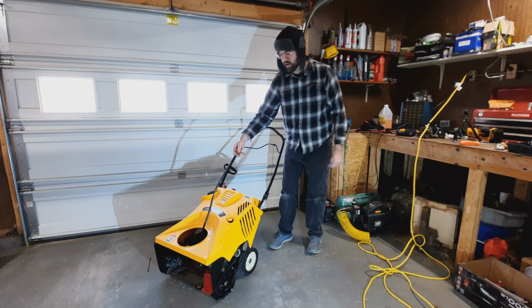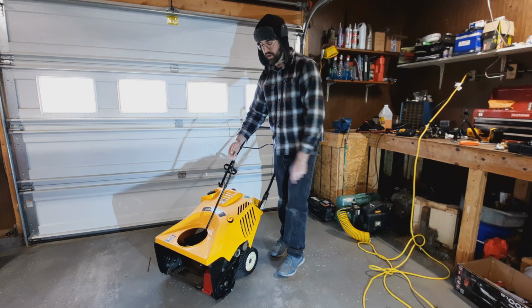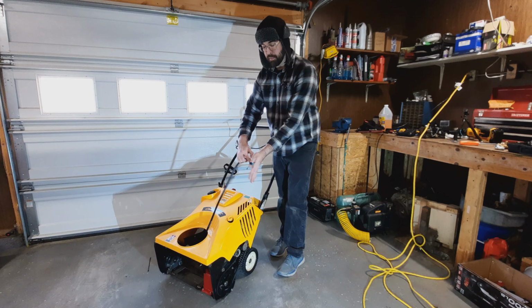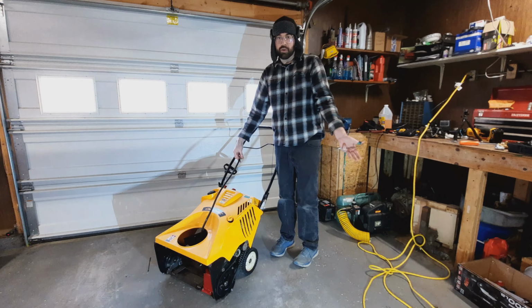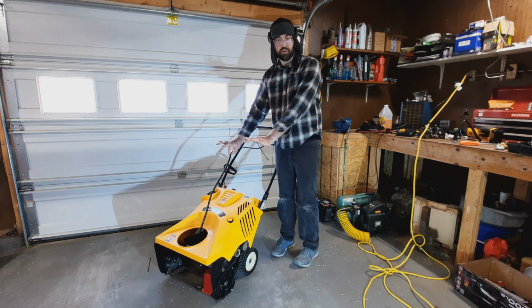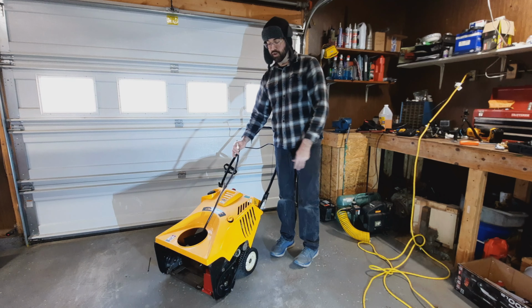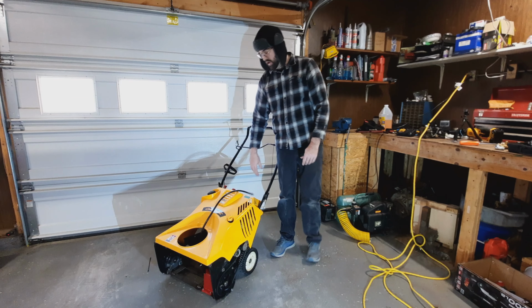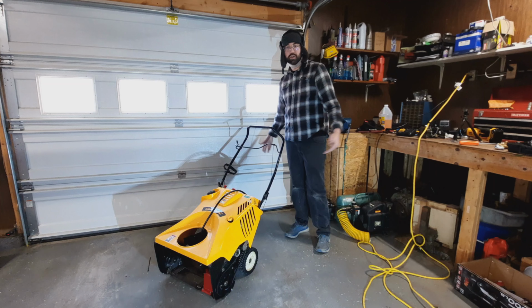This hose here is connected to the compressor, but it just has a male fitting. There's no restriction. I should be able to feel air puffing out of there once it's running. That'll tell me that it's at least compressing air. Then I can put everything on here to actually fill a tank with air. But the first thing is, let's make sure it's compressing air. So I'm going to open the door, get this thing fired up, and we'll see if it compresses some air.